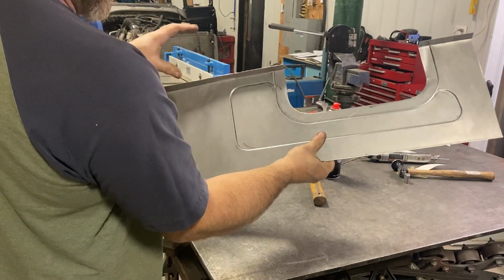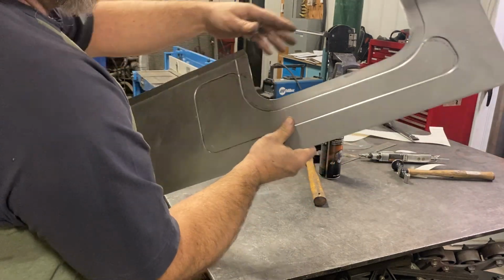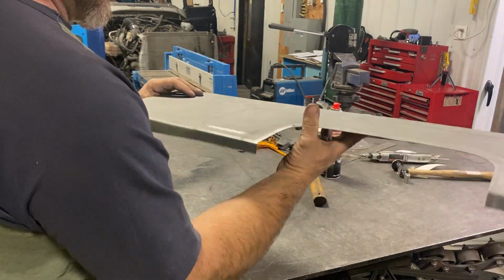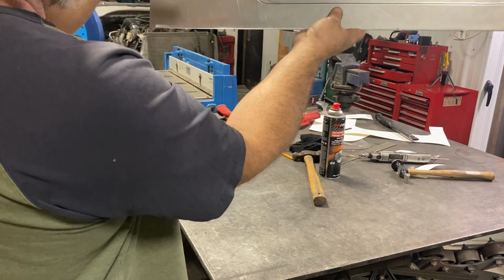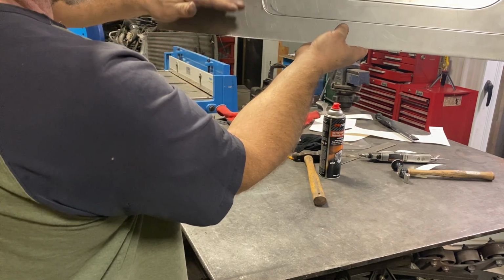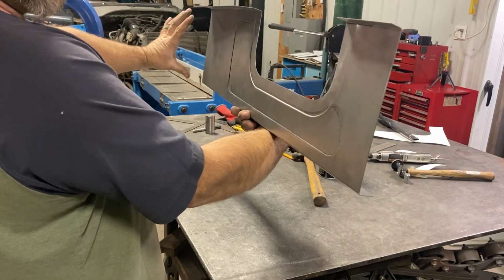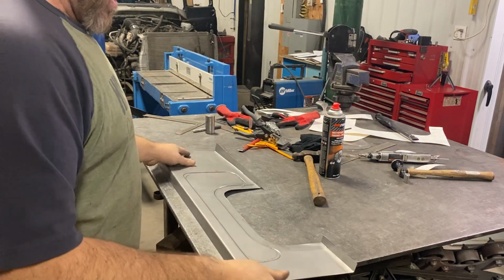really rough. When this gets shrunk and stretched, it's going to really define the corner. So not worried about that at all. I'll bend the bottom. And when all this is bent, this is a straight line, but because it's angled back and got so many curves, this is going to be bending back, which bends it up because it's on an angle. So this side, even though it's straight, it's going to look kicked up.